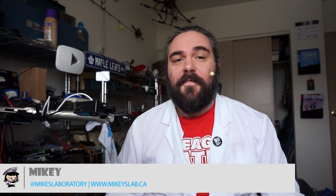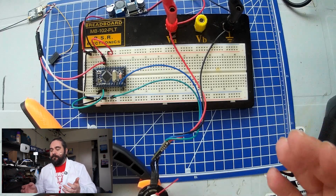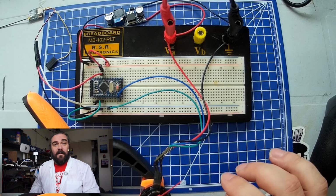Alright, so today we're looking at controlling a brushless motor through an ESC using PWM from an Arduino. We've given ourselves a little bit of a head start by reusing some of the code from consuming an iBus signal, so that we have the ability to give a signal to the motor. What we have in our setup here is the Arduino, which has our software loaded onto it, that we'll take a look at in a minute.